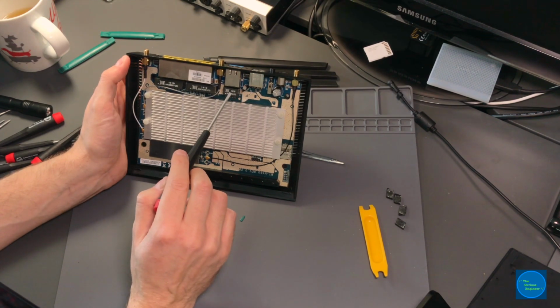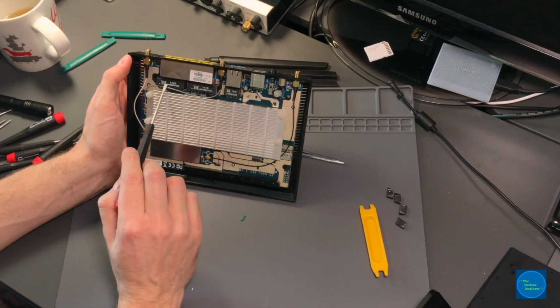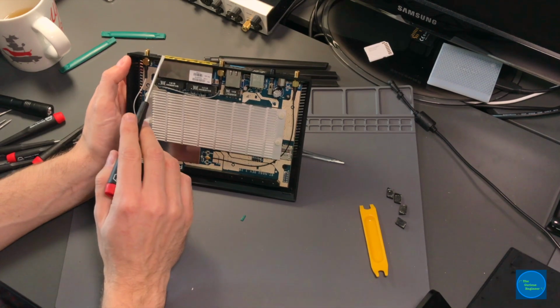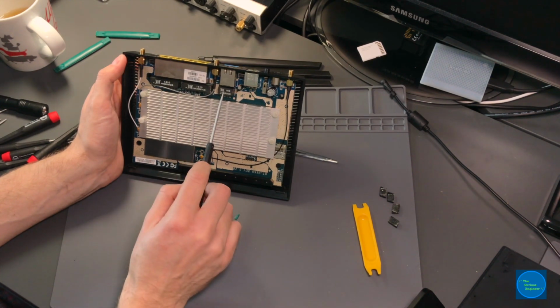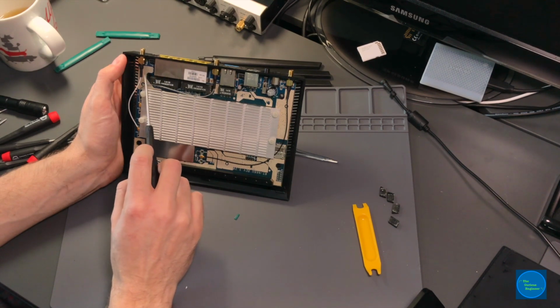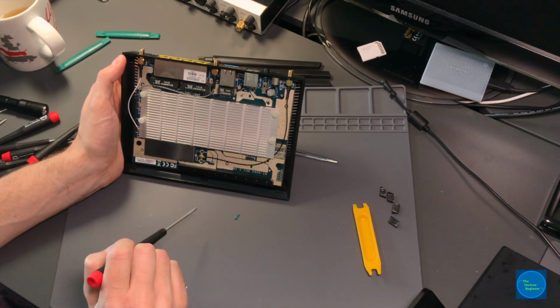This is all per Ethernet specification, they're all isolated. So these are isolation transformers that are unity. There's no step up or step down. It's just an isolation transformer for each of these. They're isolated from conducted noise. 1410 HN36201CG, which looks like it's for maybe 2 of these. And then there's the 1416 HN18101CG, which is just for the 1 port.